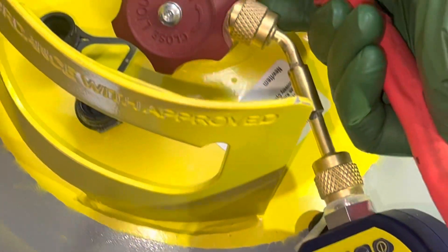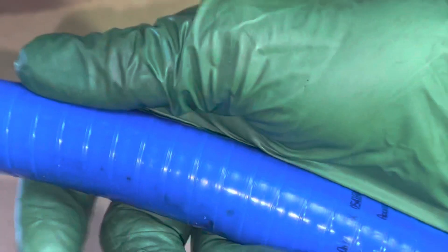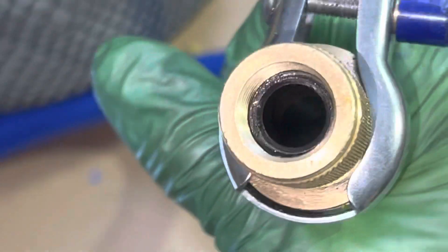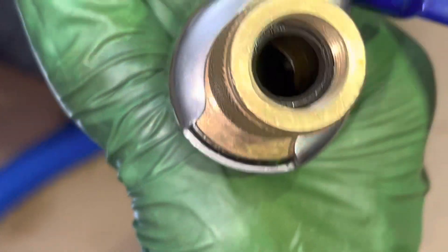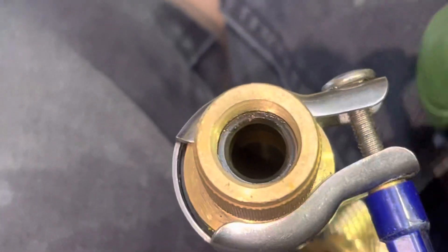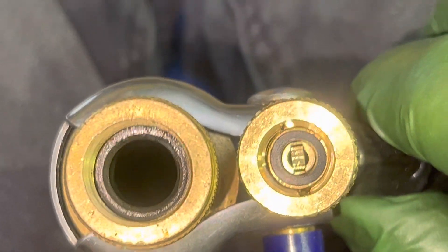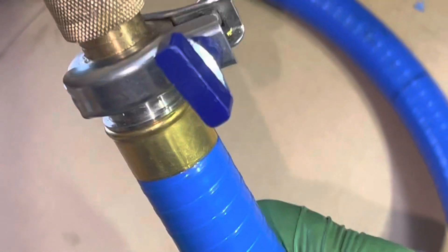To move a faster vacuum you remove that restriction. But if you want to go even faster, look at this hose — this is three-quarter inch vacuum-rated silicone hose. Look at the size of the port inside there — it's huge. If I hold this up and give you a comparison, this is the difference between what you'd be drawing vacuum through versus the restriction. This is why you use a dedicated vacuum hose.